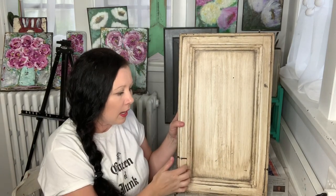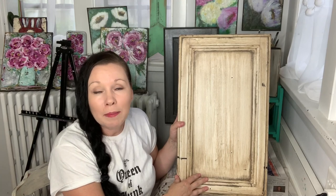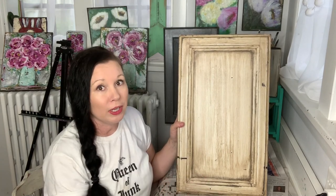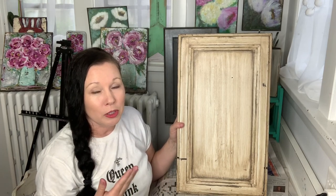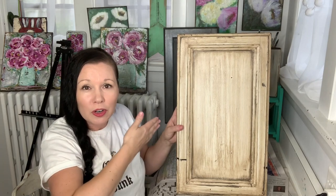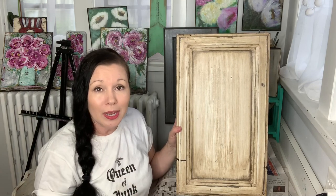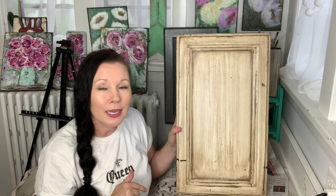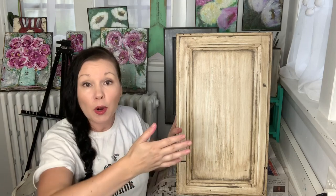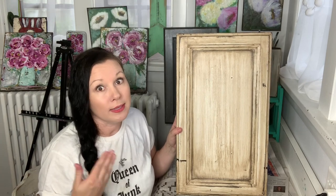That did not take long. The nice thing is, when you do that little sanding at the very beginning, if there's anything stuck onto your door, it helps things sit down nice and flat. By the way, when you begin to paint your kitchen cabinets, remember: painting is not fixing — it's not carpentry in a can. So if you can see areas that are rubbed together, doors that beat against each other and show damage, those are the types of things you want to fix before you paint. Otherwise you're going to paint, it'll look great, but the same wear is going to happen again. This is the time to sand any doors so they sit flush and don't bump or scrape when they close.